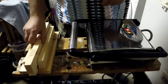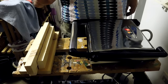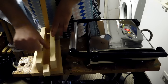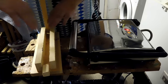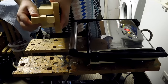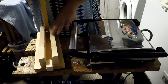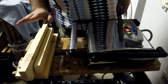For this project, I need HDPE in a specific shape. I need about three quarters of an inch bar of a square of HDPE. I'm going to melt my HDPE and use this mould to force it into the right shape. It's just a really quick mould — I'm going to melt my HDPE, jam it into the top of this thing here, and then press it down with this. There's a little stop there so it doesn't go any further than it needs to. This will squeeze the HDPE into a bar shape and constrain it while it cools. We'll wait until our plastic is melted and then we'll forge it in here.